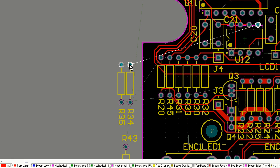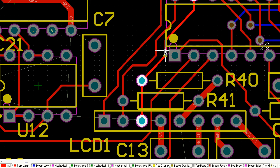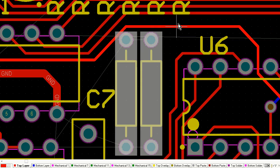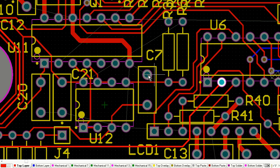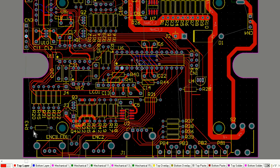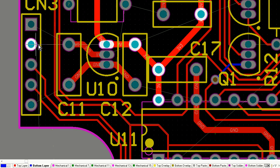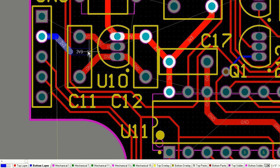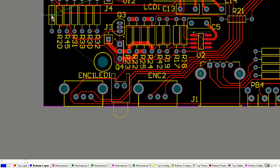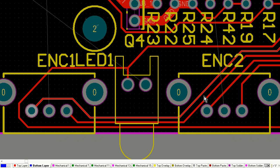Now, this is actually the first through-hole board I've laid out in many years, I think, because I'm so used to doing everything surface mount these days that a through-hole board like this is quite a novel thing for me of late. So it's a different mindset. SMD will be different again, because you can't use resistors to jump things. One of the keys with through-hole designs like this, because these resistors are so long, 0.4 inches across, is that you can fit many traces underneath, so you can use resistors to actually jump 4, 5 or 6 other traces at once, and that's very handy for routing ability and routing density on a double-sided board like this.